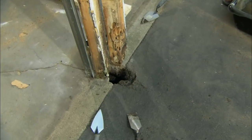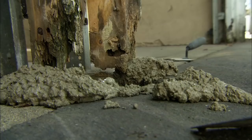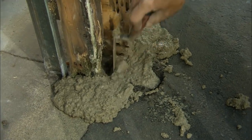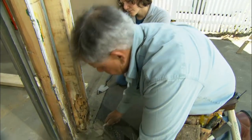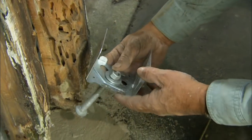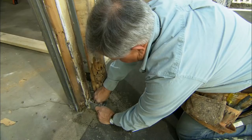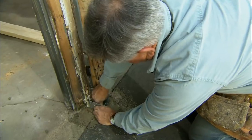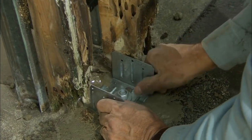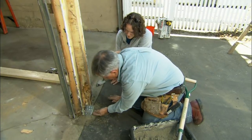I've mixed up some quick-setting concrete and we'll just fill the hole. Using a trowel, I'm going to knock all the air bubbles out of it so it fills the void nice and solid. So we can fasten the post to the concrete, we're going to use this galvanized carriage bolt with this post base. Insert it in the wet concrete and push it down so it's in the right position. I'm going to work that in nice so we have a solid connection — make it flat. Now I'm going to put this cap on top of the carriage nut, and that will keep the post off of the ground keeping it dry.